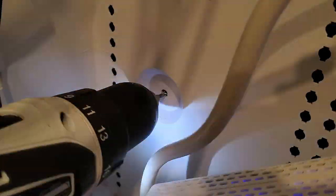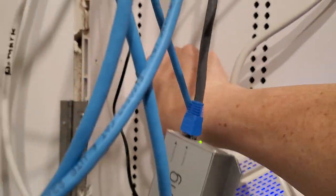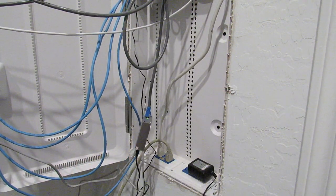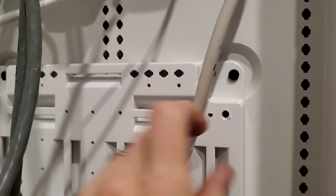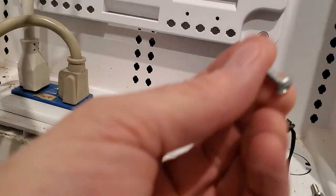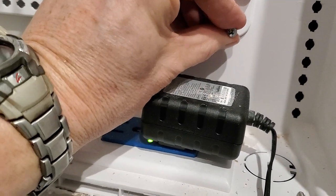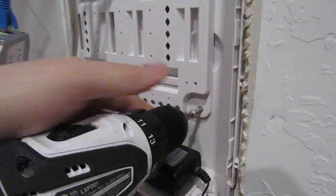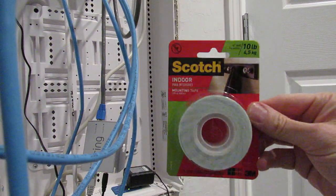I even had to drill into the existing holes so that the plunger anchors would fit. Place the plunger anchors into the holes. I only used two plungers because I used two screws for the bottom two holes that didn't line up correctly. Just a quick note — you could just use screws instead of the plungers. I found the screws to be much easier to work with, so keep that in mind. The top is totally secure. I had to drill a new hole here, and down here where there are no holes I'll drill one here and one over there as well, and put some screws in. You can see we have two plungers up top and two screws at the bottom of the bracket.